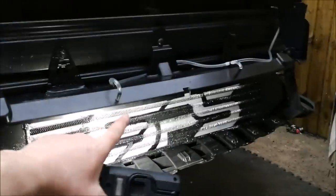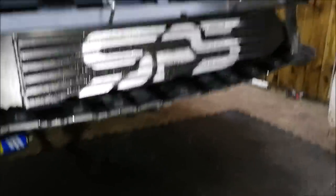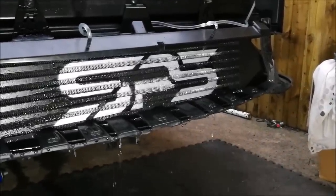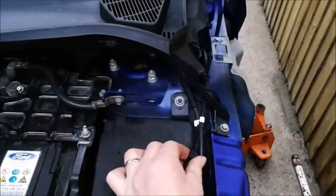So I've gone with the front sloping-down position on these two, so it's getting a good spray. Amelia's going to give it a test now — go on and give a spray. So I know it's going to get a good soak now. If I put the valve here and open that up, it's now flowing to both the back window and the intercooler. Give a spray again Amelia. So that's with it running to the front and the back — there's still plenty of spray there, and there's plenty coming out of the back window. You could have both running if you wanted to.